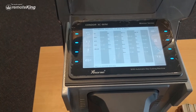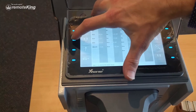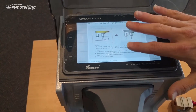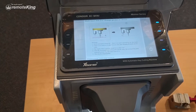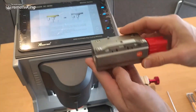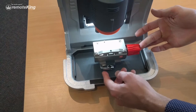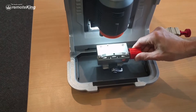The next thing we're going to move on to is the height level adjustment. Come over to height level adjustment and click — it's going to give you a little diagram and a brief description of how to do this. I'll run through it with you pretty quick. It's pretty straightforward. You want to install your M1 jaw. It will just lock straight in to the vice. Turn this lever, make sure it's firmly pushed down and the jaw will be locked.